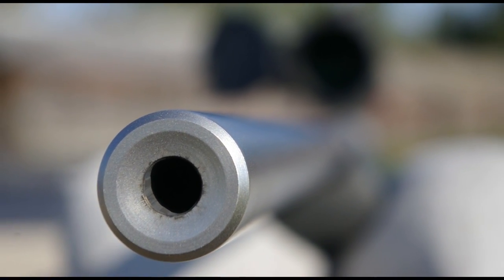The first thing I wanted to do was replace the barrel. With nearly 3,500 rounds down the tube, this factory barrel is starting to get tired. Using a borescope with a 90-degree mirror, we can take a very close look at the inside of the barrel. It's sad to think that with this many tooling marks inside you can get any kind of accuracy out of it. As you can see here, the inside surface of my barrel is extremely rough and pitted.